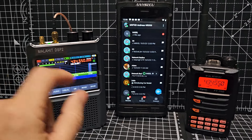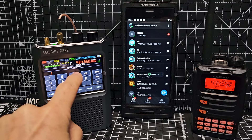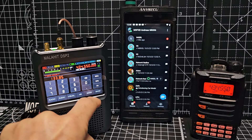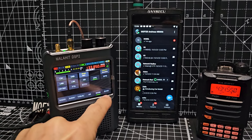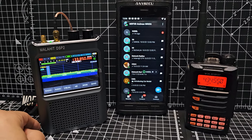Get the squelch up — that's better — and it goes red here when you enable the squelch in audio. If I want I could type in airband. The antenna we've got on isn't an airband antenna, but it's already on airband mode and it's automatically detected that we're going to use AM.